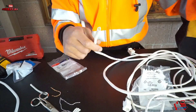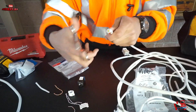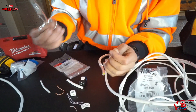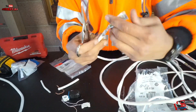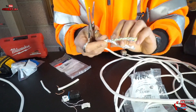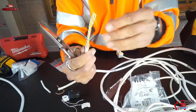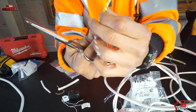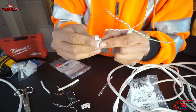Last but not least, I'm going to teach you guys on the Cat6A cable. Remember, Cat6 is smaller and this one's thicker — even the color coding. So be careful with the snips. This is the one I'm actually working with right now. This one comes with aluminum foil protecting the cables, so be really really gentle. You unfoil it, then you remove the other plastic. This one's way faster — it's used for connecting cameras. And then we have this yellow plastic inside dividing the cables so they won't get ruined. You cut that off.